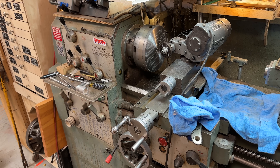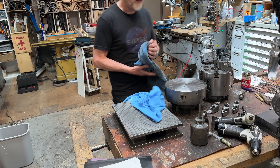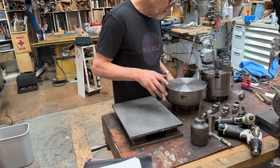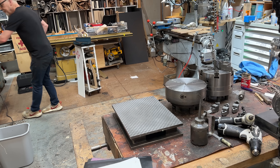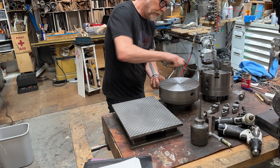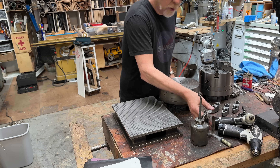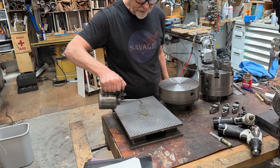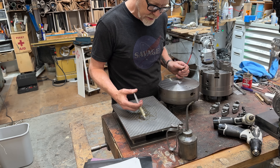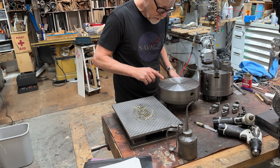Now, when I say I'm going to take a lap, I don't mean that I'm a gym teacher giving one piece of advice. I mean I'm going to use this lapping plate and get this superiorly flat. Let me turn it back off again. Now we have it off of the lathe — we can wipe off all that metal. I'm going to put down a cutting oil base and then put some 400 grit on top of that and get to lapping.